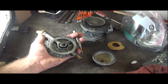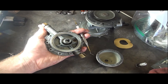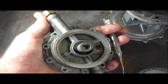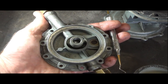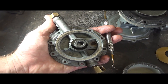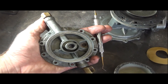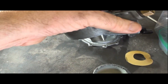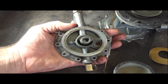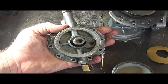While I'm here working on the underside, I'll finish cleaning up. I've got a very soft, blunt pick and I'm able to go around and remove that old gasket material. When I first got the car I tried to do this upside-down while it was on the engine and couldn't hardly get to it, but now with the whole assembly off I can do a proper job cleaning this surface completely — getting rid of all that old cork gasket material.